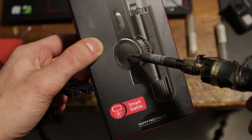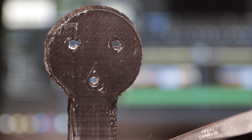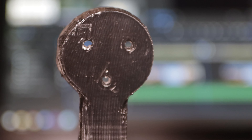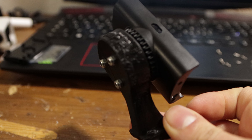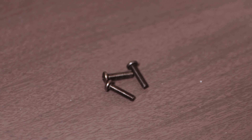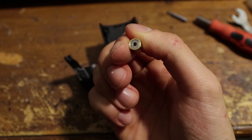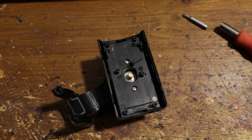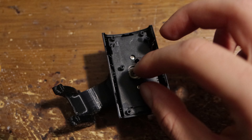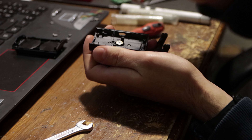To reassemble it, you need to drill three holes on the back by aligning the printed attachment to mark the holes and then making them with a drill or a soldering iron. I prefer the iron because it's plastic and reduces stress around the holes. Trust me, I'm an engineer — almost, hopefully in a couple of years. After that, fit 10 to 15 millimeter M3 screws from the inside and put rubber nuts on the back. Then put the nut back on — it's very easy to forget and I did it twice. Don't forget the nut. Now solder the motor wires and screw the board in place.